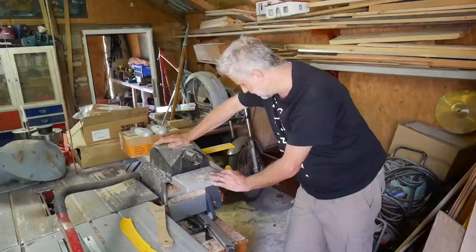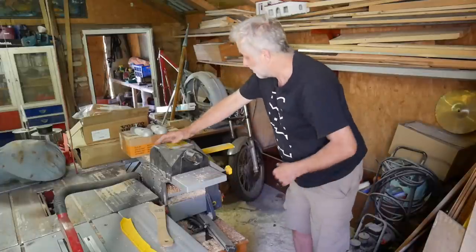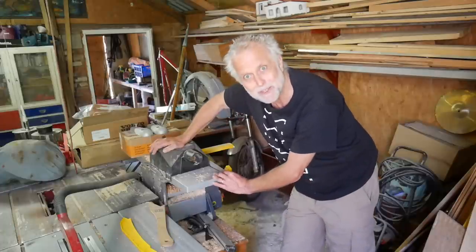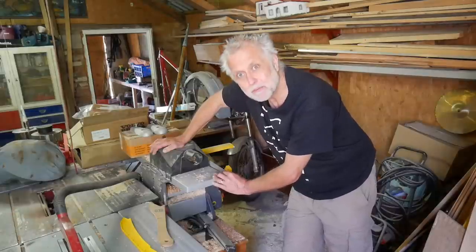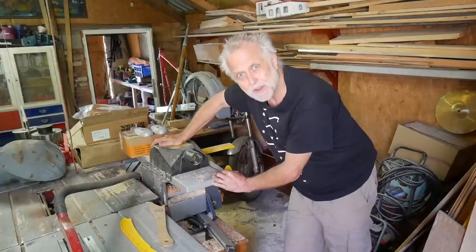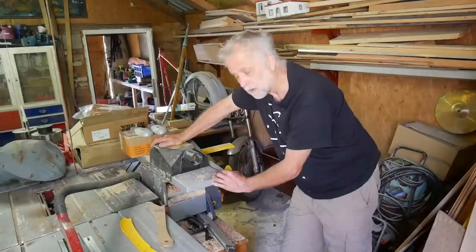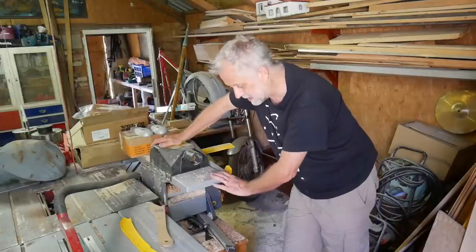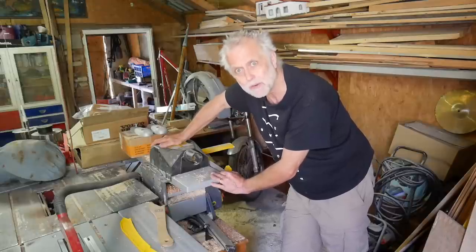It's also a Scheppach. It's also got a thermal cutout on it, on-off switch, height adjustment, obviously, to adjust the thicknessing capabilities or levels. And very good. When I got it, I put a new set of blades in it. They're readily available. Got them on Amazon, I think. You can sharpen them as well, but I put a new set in and it cuts really nicely. And it has been a valuable addition to the workshop, certainly.